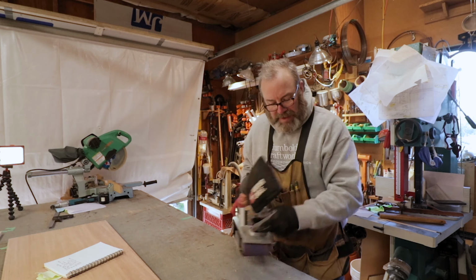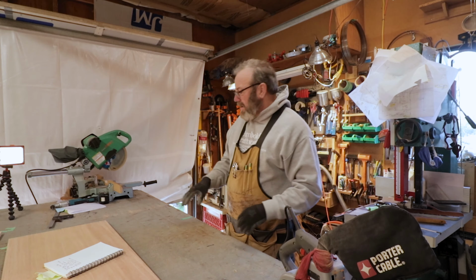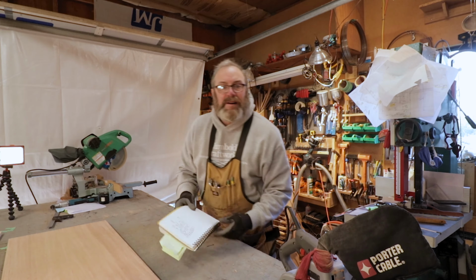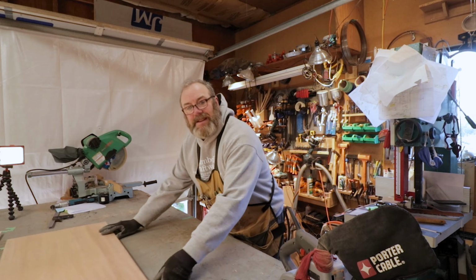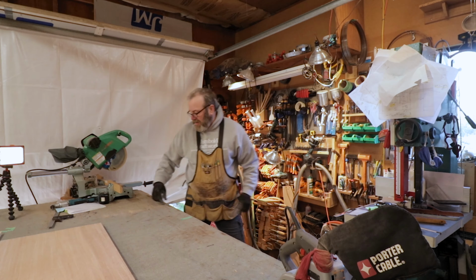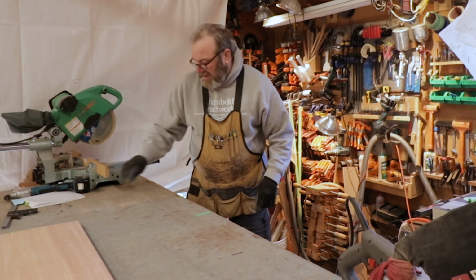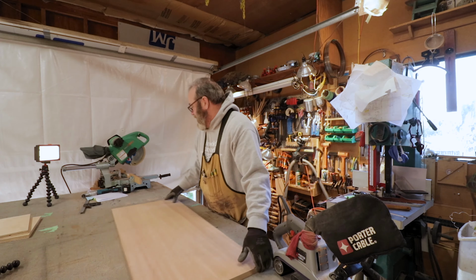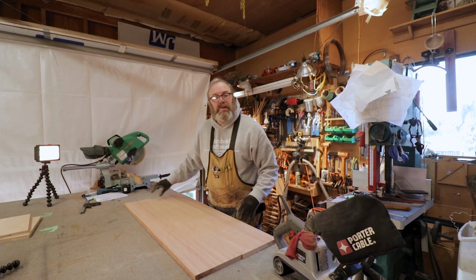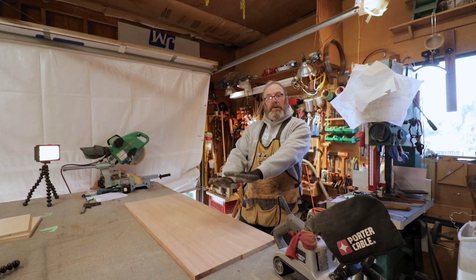But let's go over a few other things first. For your piece of wood, I don't clamp it because clamps get in the way. I put screws. I don't know if you can see these little screws, but two little screws. I just screw them into my worktop. It's a mess. Then the piece will just butt into that, so it works like a bench dog. Ain't going anywhere.